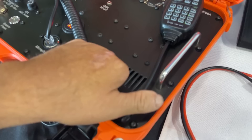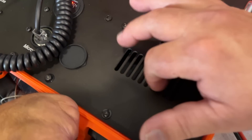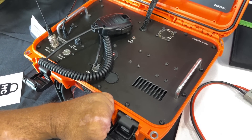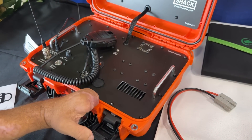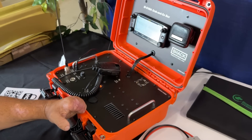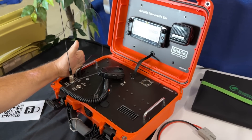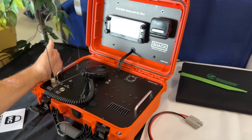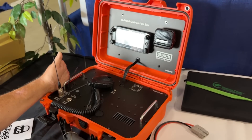They took care of cooling again — with an aerospace engineer on the team who's great with fluid dynamics, drawing air into the intake. The front panel is eighth-inch aluminum — anodized, robust, and made in the United States. Aviation grade hardware is used throughout. Everything is connected to the top panel with no intrusions into the box, making it fully sealed. The IC-705 version uses a neoprene washer, making it IP67. They're working to mount everything to the top panel on future builds; this particular box was built just the prior Tuesday once they finally found a diplexer that fit.